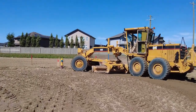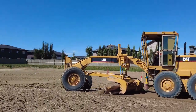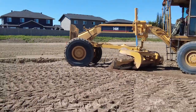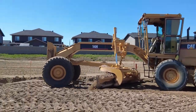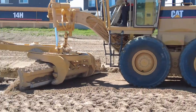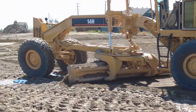The bubble has been watered and packed with a pad foot. I didn't actually place this gravel in here — Andre placed it in here with a skid steer. I'm just coming in here to smooth it out and shape it up a little bit. It's a 20 mil road crush, and this bubble has a crown in it — about a 300 millimeter crown.